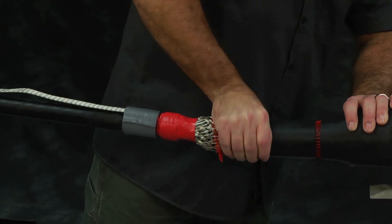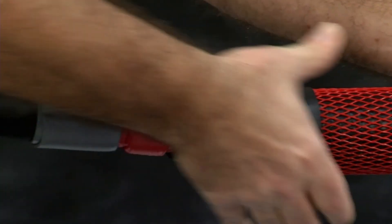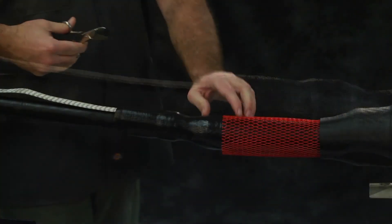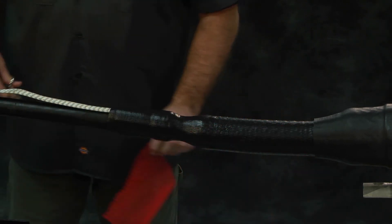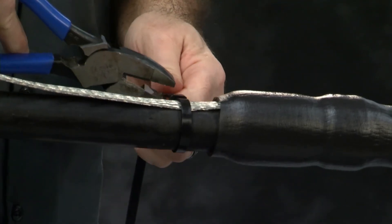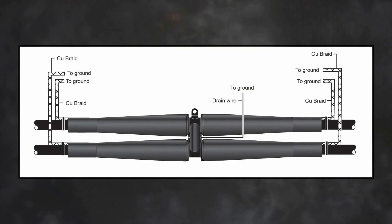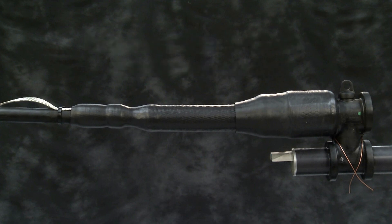Twist the black re-jacketing sleeve from side to side to release the grease. Slide the re-jacketing sleeve over the ground braid and onto the cable jacket. Cut off the red mesh sleeve, being careful not to damage the jacket or the splice body. Connect neutrals. Install cable tie to secure the ground braid. Connect the ground braid and the bleed wire to system, following your company's grounding standards. Repeat steps 8 through 17 on remaining cables. This completes the splice.